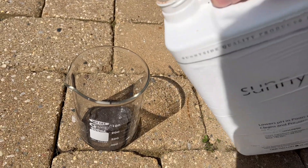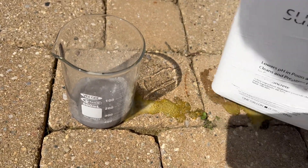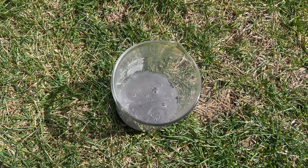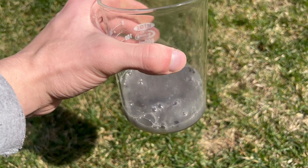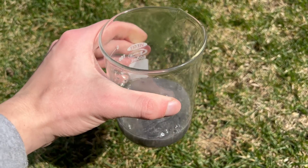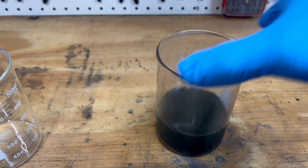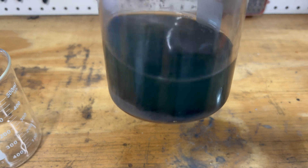I then took off the zinc and placed it into the beaker. Zinc can easily be dissolved in hydrochloric acid, but the silver will be left alone. I might have scraped off some lead here, which will not be affected by the acid also, and all the lead will be removed in the final step. Now with the zinc dissolved, I can remove the acid and wash it a few times with water.